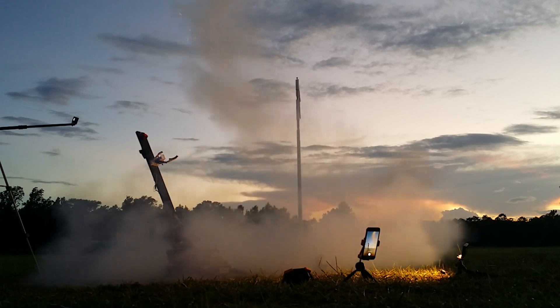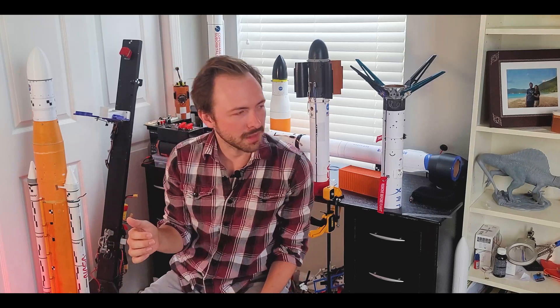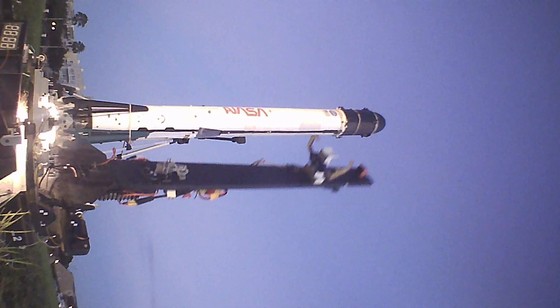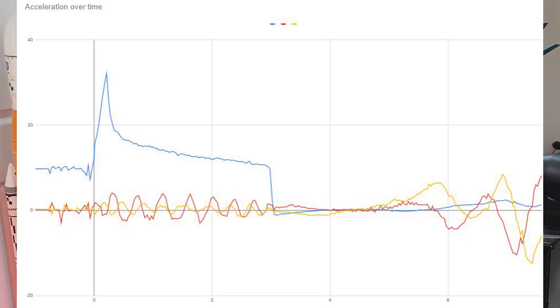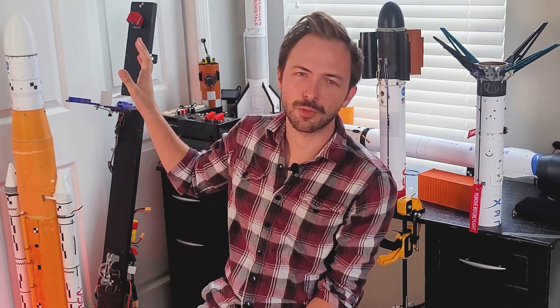As I build more confidence, we're going to be pushing more towards getting back on track on flying a two-stage vehicle. Looking forward, I want to try and do more deployments in air — like lighting a second engine to continue the ascent phase, or extending the burn time and trying to fly higher while collecting more data on the control system in different circumstances. We're getting pretty close to a two-stage flight. I feel more confident in the software, which has meant I've reactivated my SLS program to fly that on software I know will work.